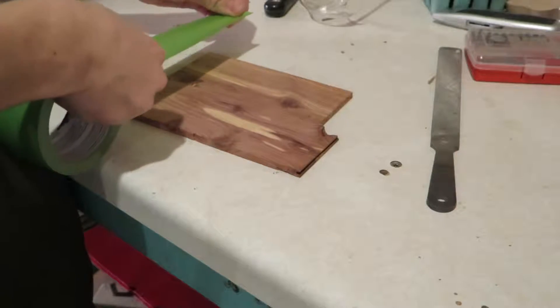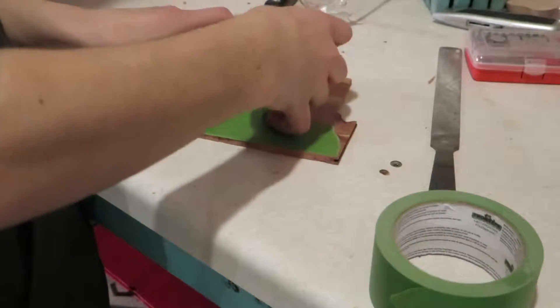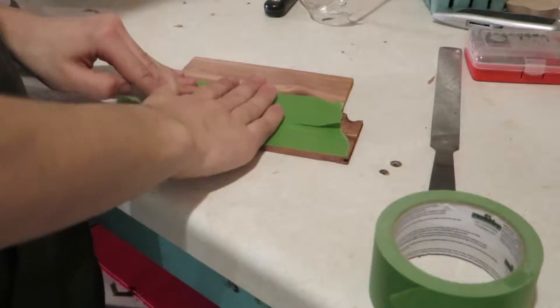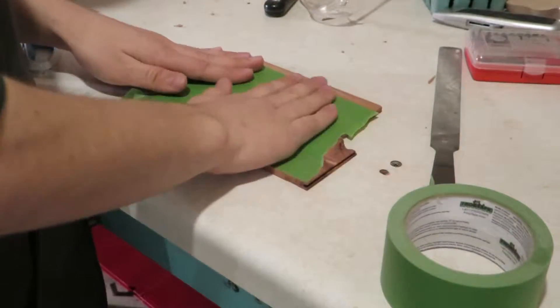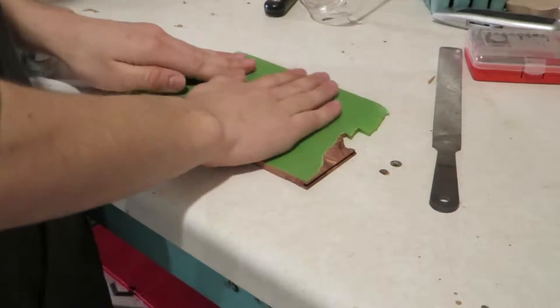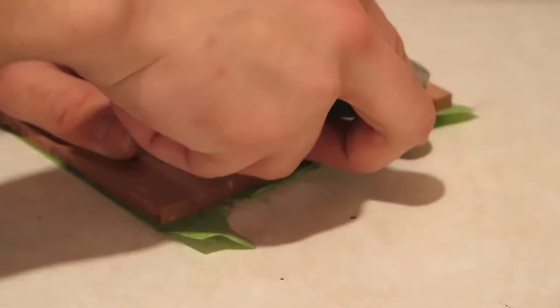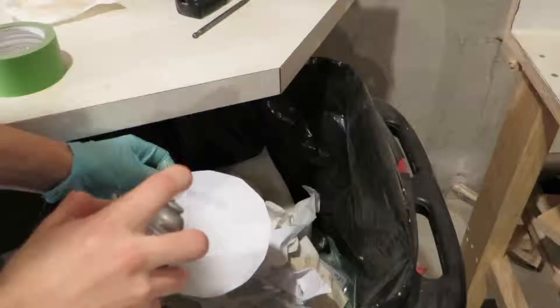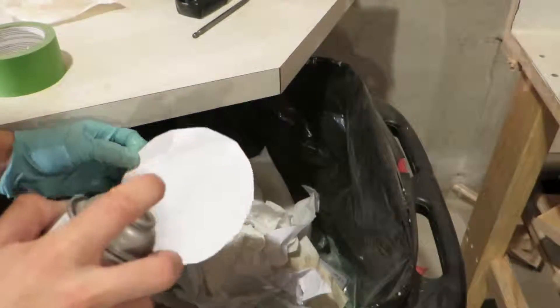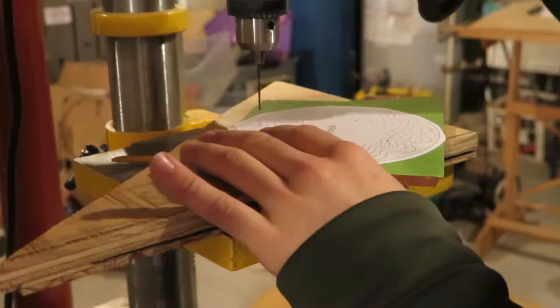Now I like to put this green painter's tape, or just glue tape, on the board, and that'll help protect the surface when we put some sprayed pieces on the pattern. The pattern we will be using today is a bowl pattern from Steve Good's Scroll Saw Workshop, and I'll put a link in the description to this pattern. Make sure you give a donation to Steve Good, because these patterns are free but it's a really nice service. This is the spray adhesive I use — 3M General Purpose — just give it a nice little coat and stick it on the tape. You don't have to worry about the adhesive drying because we put the tape on.